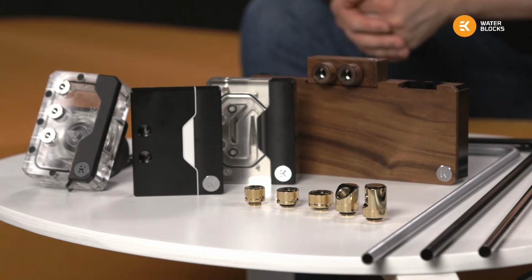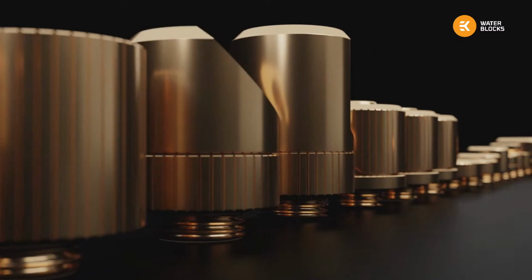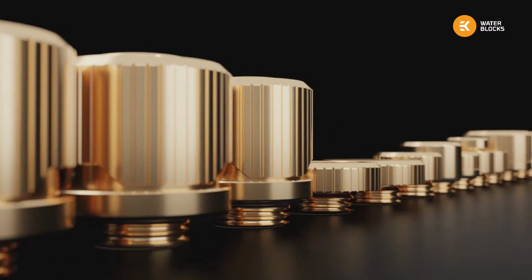The reason behind white is one of our highest demanded options to add to fittings, and we would love to do it, but we also don't want to compromise the perfectly sharp design that we have. Because all of our fittings are turned, they all have really exceptionally sharp corners, really sharp knurling details that are actually broached, similar to skiving, like the metal is just pushed out. They're not indented like other knurling, so they're super sharp and fine, and painting all this stuff white, if it's a heavy coating, really spoils the shape of the fitting.